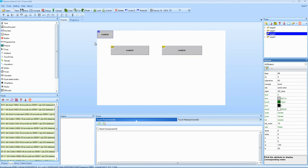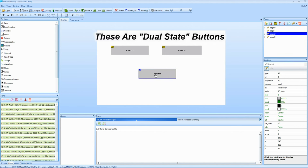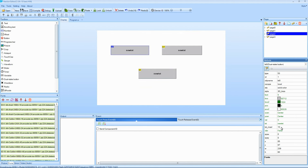The buttons on the first page were simple, what we call momentary contact buttons, where these two at the top here are going to be more like a toggle switch, push for on and then push again for off sort of thing, and they'll stay latched if that makes any sense. They're going to be more like an actual power button, which was what I want for the preamps to be turned on and off. So they're going to latch.